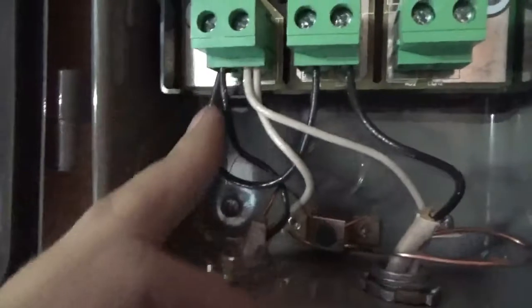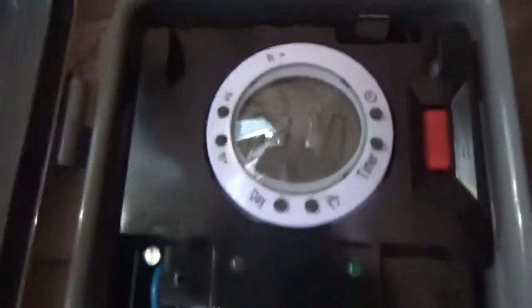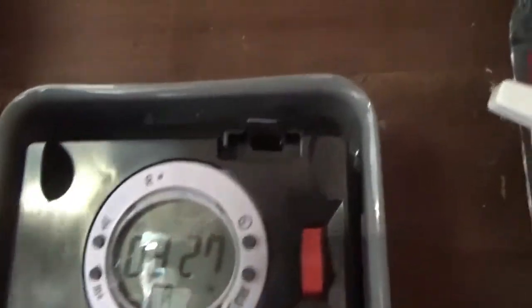It's wired in, power still off at the switch. This is the power coming in. You've got your main 120 hot wire coming in here, plus a jumper which goes to L3 or terminal 3. Then you've got the hot for the load at terminal 4, which goes out to the switch up here. When it's on, it'll send power to the lights outside. Both neutrals are under terminal 2, and the two grounds get connected to the ground screw. I want to make sure everything's wired correctly before I put a cover on it.